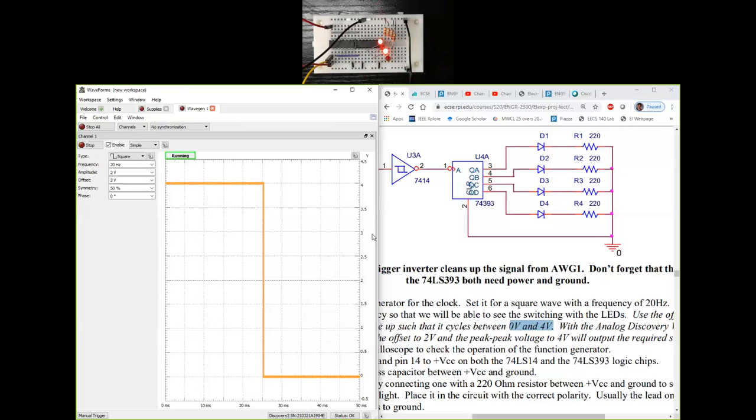One question that we can ask at this point is, did they start counting at 0000? Well, the answer is no. They didn't start at 0000. They started at some arbitrary starting point, and then they started counting from there. They went to 1111, then they came back to 0000, and then they kept in the loop. If we wanted to specifically start at 0000, we can only do that by using that clear input, connect it to 1, connect it back to 0, and then start the counter, which we didn't do here. So we just started at some arbitrary count value and then started counting from there.